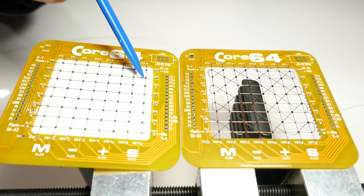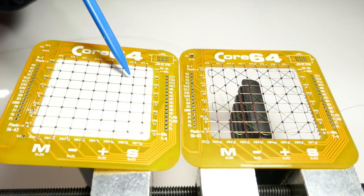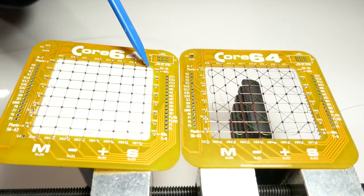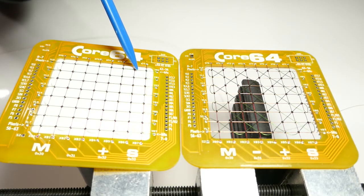There's a 2 over here, and what that means is you're going to just run the wire all the way through, and when you get here and you wonder which way to go, you're looking for the 2, so head towards the 2, wrap around this post to get a nice bend, and then head through this core, which takes you in this direction. You get to this one, this is 3.